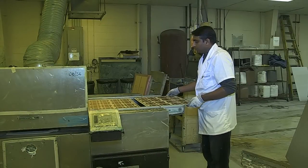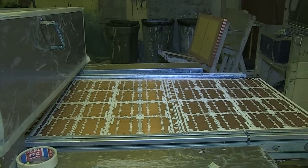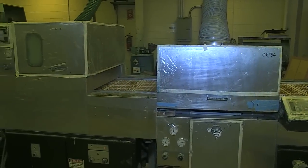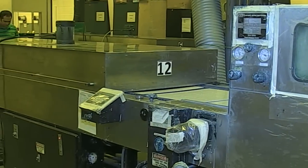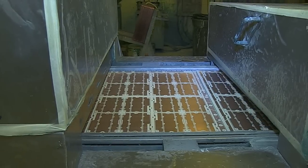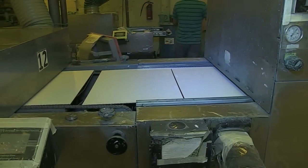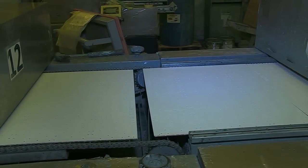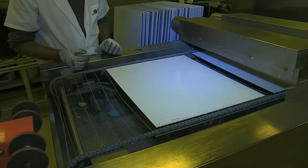The panels are now ready for solder mask application. Most boards have epoxy ink solder mask printed onto each side to protect the copper surface and prevent solder shorting between components during assembly. To protect the copper features permanently, we apply a coating of solder mask. We utilize two high production spray coating lines. These machines spray the surface of the panel with a coating of solder mask, providing a much more uniform thickness across the panel since it is a non-contact method of application. Solder mask is known as liquid photo imageable, or LPI. The panels are now racked and put through a conveyorized dryer which hardens the resist just enough to allow it to be printed, or tack dried.